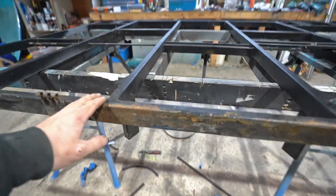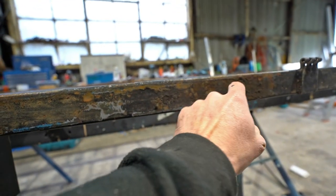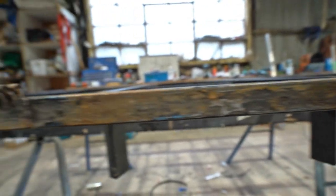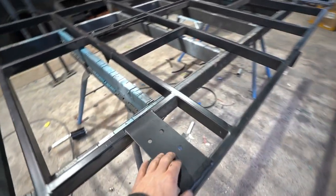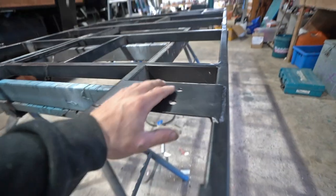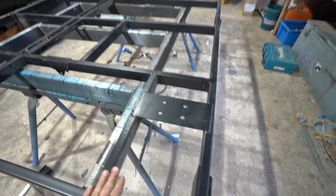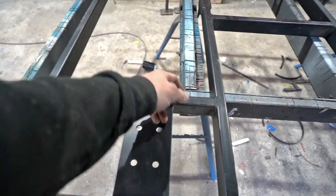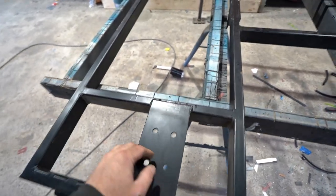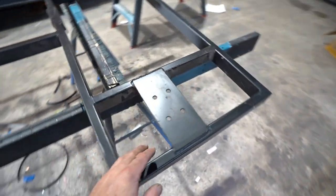I've put it on the sawhorses now. You can see there's a lot of rust along here because where I had this stored it was basically sitting in a muddy puddle for about 12 months, so that's all rusted up. I'll just hit that with a wire brush and touch it up. Around the front here, where the support legs bolt on, I welded the plates on top of the frame — I don't know what I was thinking. I'm using aluminium decking on top so that's going to cause a problem. I can either notch the bottom of the aluminium decking, which probably wouldn't look good, or I can cut these plates off and sink them flush with the top of the frame. That's what I'm going to do.